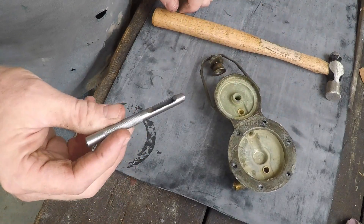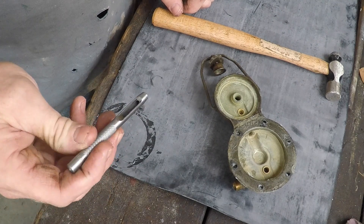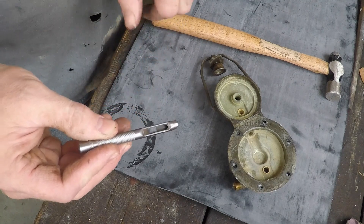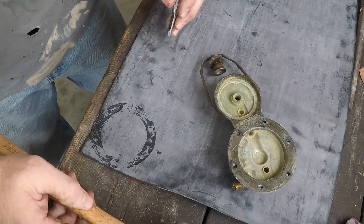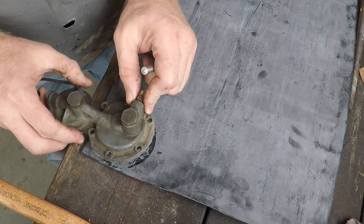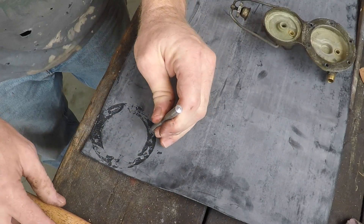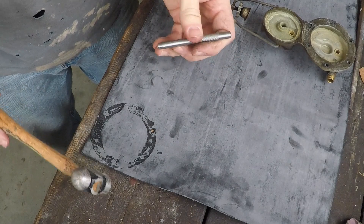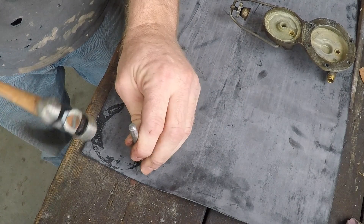Now to cut these holes, I'm just going to use one of these tool store hole punches. When you get these, often the edges are going to be really sharp — they cut you easy, so I hit that with the grinder to knock that down. All you've got to do is line up on the holes and punch them out. Make sure you're doing this on a piece of wood as a sacrificial surface. You get a nice hole if you hit it hard.